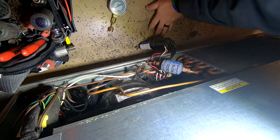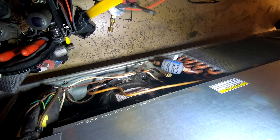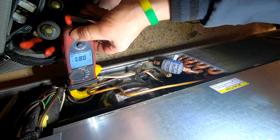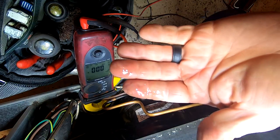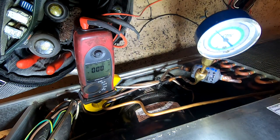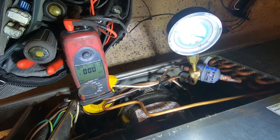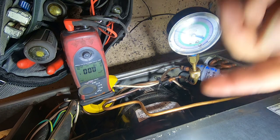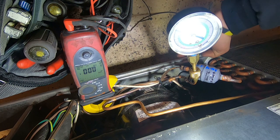The start components did seem fine - the start capacitor and start relay shake back and forth like they were okay. Just for giggles, I'm going to hook the original start components back up, lock us into AC amps, and watch the pressures. Man, that oil smells bad. She's pulling 50-some amps - she's got locked rotor. The locked rotor on this compressor is 40, so the compressor's bad. Made a good guess and I was correct.